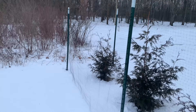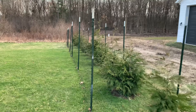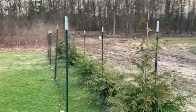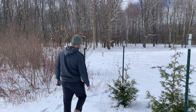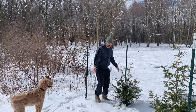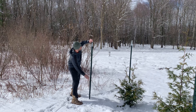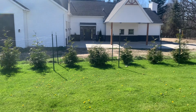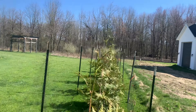Here we are at the end of February — no problems. This snow did not stick to the fence and pull it down; no repairs required. In the middle of March the fence is stretched out and sagging, but still intact and operational. At the end of March I noticed this end disconnected from the post — those zip tie connections are weak and the snow likely pulled it down — so I re-zip tied it back. By mid-April, that is the end of the season, and I am done with this temporary fence. It held up with no additional issues.